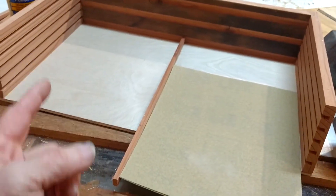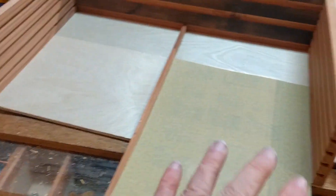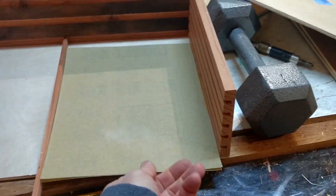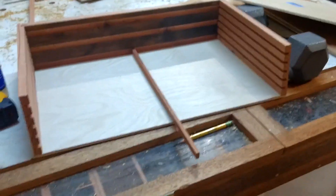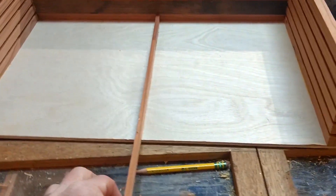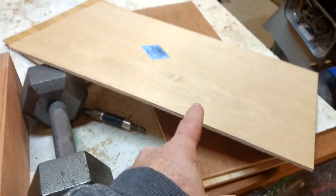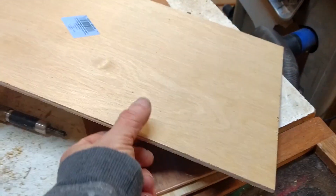I've got multiple layers here, so I should be able to get about ten different grits — actually twelve different grits of sandpaper sheets stored in here once it's put together. But I kind of made it too small so I'm really squeezed for space. It's a painstaking process of gluing down a little divider here for the sheets to sit on, then sliding another piece into a groove, gluing another piece down on top of that, sliding another piece in, gluing until we get to the top. And then I've got to cut a little cutout here so you can reach and grab the paper, otherwise it's hard to get the edge of it. That's going to make it easier to grab hold of.